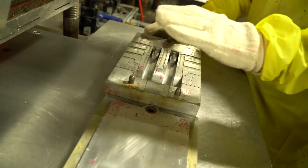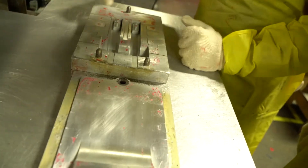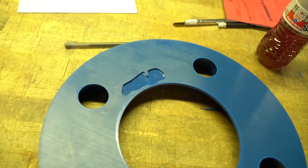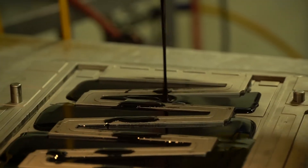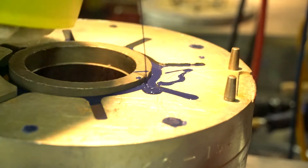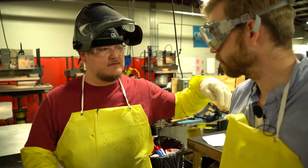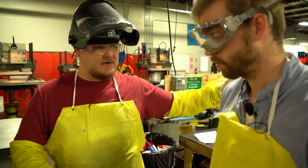The whole idea of molding is you want to pour at the back of the cavity and let it flow through, because you're pushing the air out. If you start pouring at the front, you trap air in these little thin walls and cause voids — and voids will likely cause the part to fail. You don't want to dump it in fast; take your time, pour right in the center, and let it ease in. Once the hardener hits the cup, move straight to the scale, zero it out, add eight grams of red, and add a drop of SAG, which is the degasser.